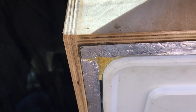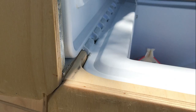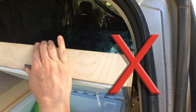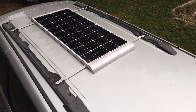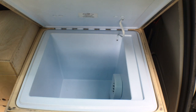You can get a good look here at the construction of the boxes. They are all 3/8ths of an inch Baltic birch plywood, put together with simple butt joints that are glued, pinned, and clamped, and left to dry overnight. The cooler lid uses the cooler's own hinges to open and close the wood casing. You can see the screws I added to keep the wood lid in place, and the way I cut back the edge to allow the lid to fully open — though ironically, I can't open it all the way because the edge of the van is in the way. So do I spend money adding more solar and another battery, or do I change the cooler? A second battery would be another 60-70 pounds of weight. And in the end, a cooler that can't cool more than 20 degrees below ambient is just not worth it.